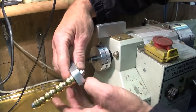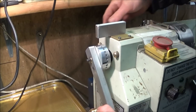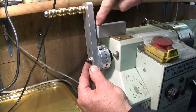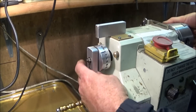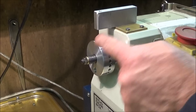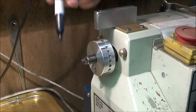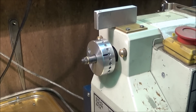You then have the quick-release handle which goes on the back, which you can use for screw tapping, die work, or whatever. When this handle is on there, the back face misses this block by about five or six millimetres, so that's good. The hole position from this end face leaves a nice diameter which you can use a Sharpie marker pen on to mark whatever holes you're going to be drilling or milling on the component.